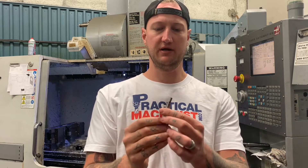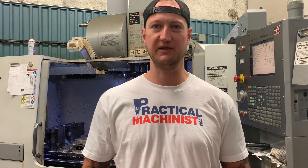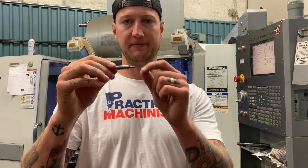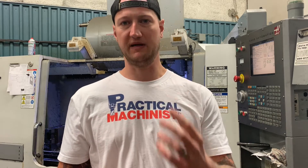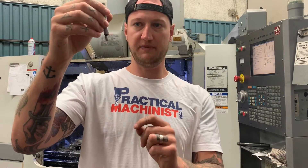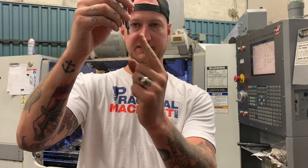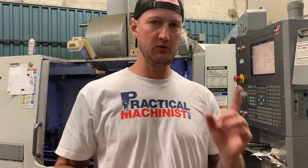The way this works is you want to spin this at 1000 RPM. I don't know if that's a tried and true must-always-be type thing, but that's the way I was always taught and that's the way I use them. So I'm going to put it in a CAT40 tool holder and spin it at 1000 RPM. The way you use one of these is it's a visual guide to picking up your zeros — they're very accurate when you learn how to use them correctly. Spinning at 1000 RPM, we're going to approach the edge of our part and it's going to be spinning off center. As soon as I see it line up, I'll know I'm very close. When I see it kick out again and become off center, I know I've found my zero, or I'm about one thou past.